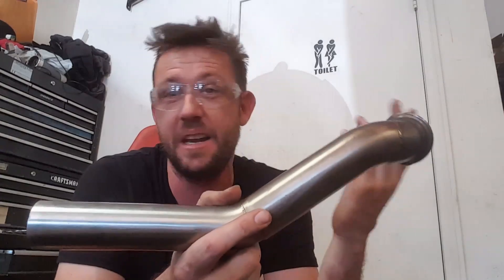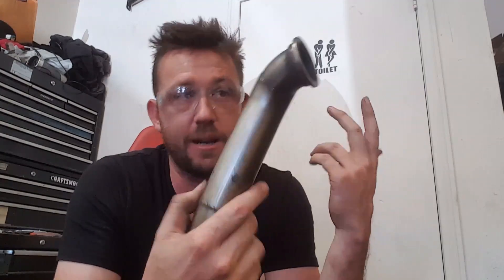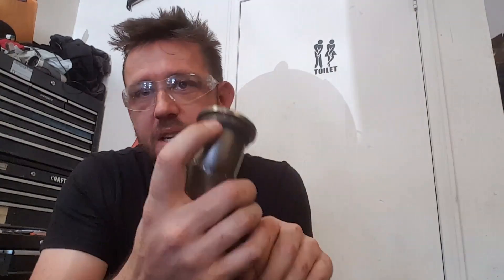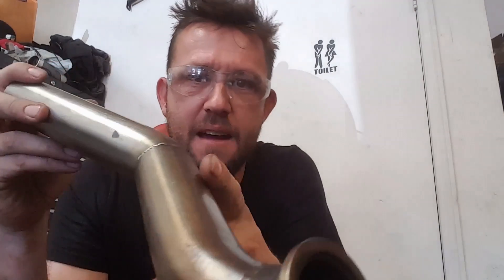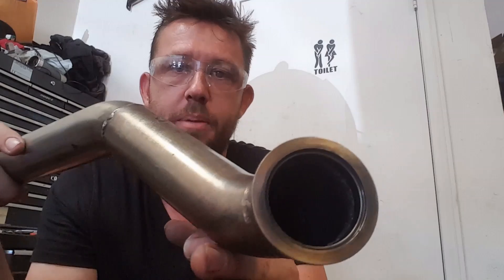That's not really the problem — we're not beating anybody up over this. It's good quality stainless, it's got a nice ring to it, it's not cheap mystery metal, it's straight up legit stainless. The weld goes all the way around. But if I can get in the light just right here — you can kind of see it — we've got a crack. The crack starts from about right here and ends about right there, so more than 180 degrees of this weld is cracked. The problem actually lies on the inside: whoever built this piece got full penetration all the way through, but there was no purge on it. Full penetration, but no purge.